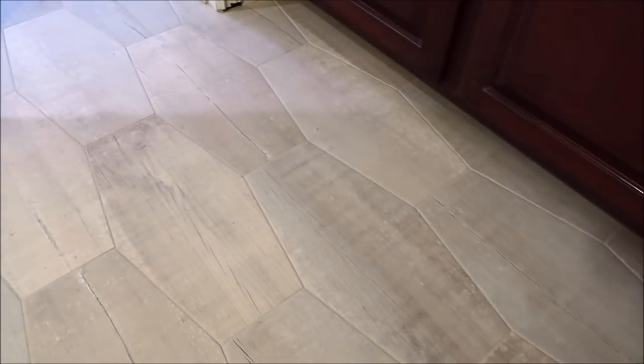We'll first start with the floor. We installed a 9-inch by 19-inch hex tile — this is porcelain. We used 1/16-inch spacers, and a tile leveling system was used on the entire floor: Lifttech. The floor turned out great, absolutely beautiful — a modern-looking porcelain hex tile that resembles a wood look, as you can see from the grains.